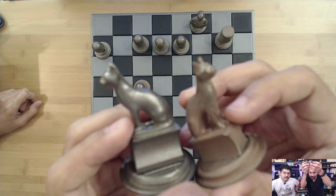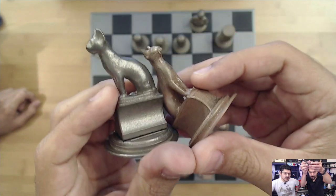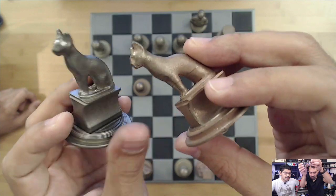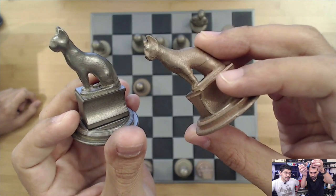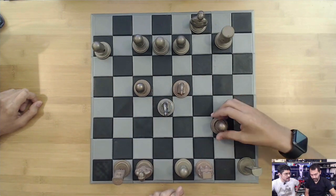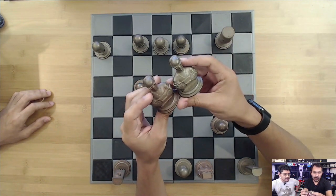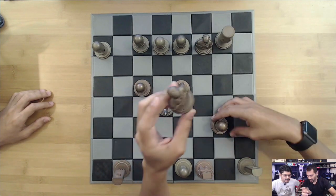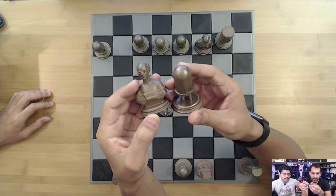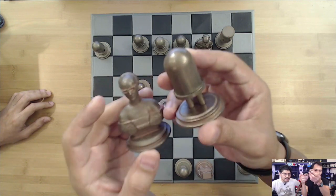One thing we noticed is because they look so similar — the medium actually degrades over time. As you use your brass screws on copper parts, you get less and less of a finish, mainly because the brass golden flakes are being impregnated into the material. That's what gives it that brilliant shine. And over time it also oxidizes, so you can see a comparison between something that just came out of the tumbler versus one from last week.